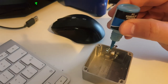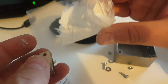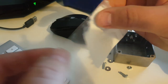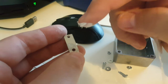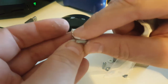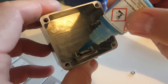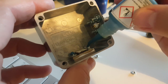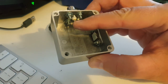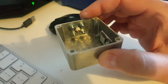Don't forget a little dab of Loctite or similar compound. For the resistor, I'm going to use some thermal grease — we never seem to have enough of it and it's not always easy to find, but I would highly suggest using it for this application. With the Loctite to make sure it doesn't come loose, that's it for the mechanical part. Now I just have to solder a wire between the center of the BNC and a little tab here.